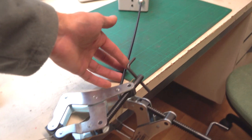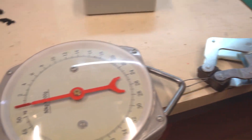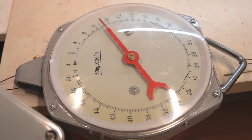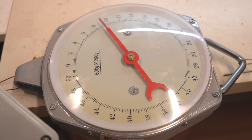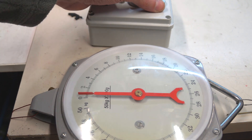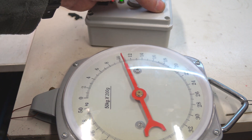I measured the full pull force on the steel rope before mounting. I got about 9 kg of full force at 5 volts. Then I set the BEC to 6 volts — with 6 volts that servo can pull about 11 kg. The spring or motor pump needs just a few kg, so I went back to 5 volts to gain some extra hours of servo lifetime.